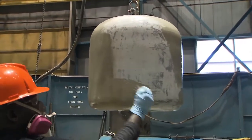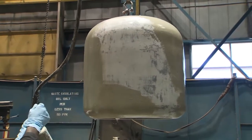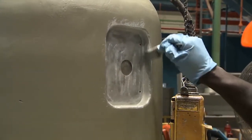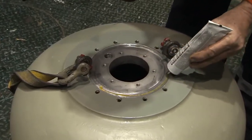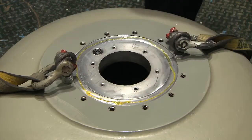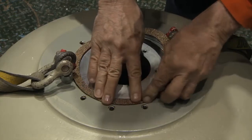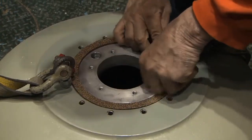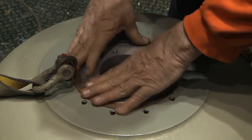For the side of the tank, standard gray paint is used since there is no direct contact with the transformer and a dielectric paint is not required. The area set back on the side of the tank where the level gauge display will be inserted should be coated with a water-based primer only. Apply a very small amount of gasket adhesive inside the center of the channel where the gasket will be seated, then place the gasket in the channel pressing firmly all around the circumference to make sure it is seated properly. Pay close attention to any areas that are raised — the gasket must remain flat all the way around inside the channel for there to be an effective seal.